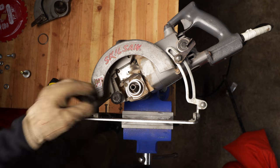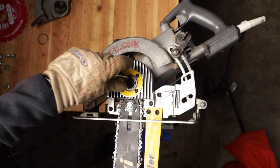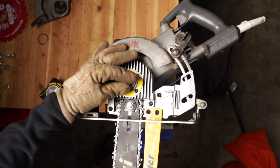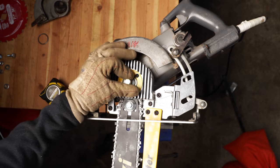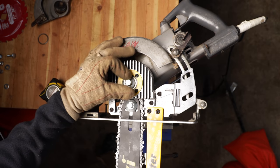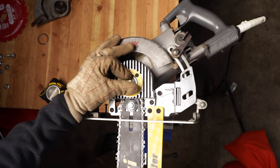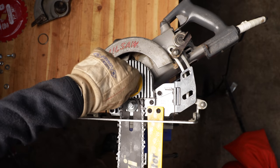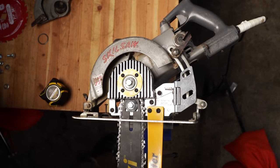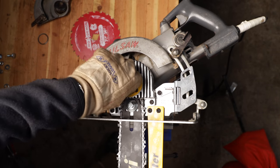Let's go ahead and install this together. It came with this bushing here that replaced the factory bushing, so that drops in. Now remember, on our skill saws we are always backwards thread. Why backwards thread? Well, the way that it rotates so that when it's turning it's always tightening itself and not loosening itself. You don't want a loose skill saw blade — it'd be like having the devil's Chinese star flying around on your job site.